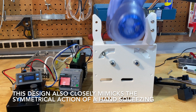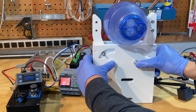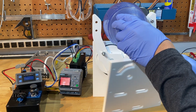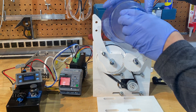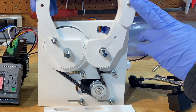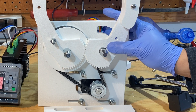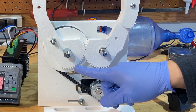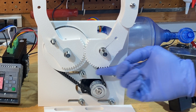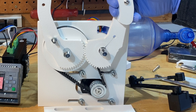And it's also easy to remove the bag without disconnecting any hoses. I can show you what it looks like under the hood. I'm using a stepper motor with a belt to actuate the arms. I was a little worried about machining a small plastic gear to drive these teeth, so I think the belt for my case will be a little more robust.